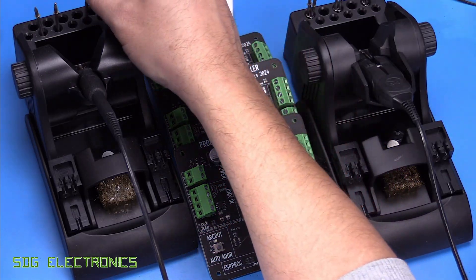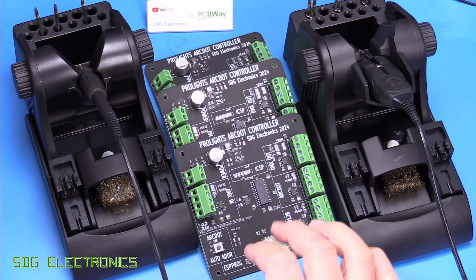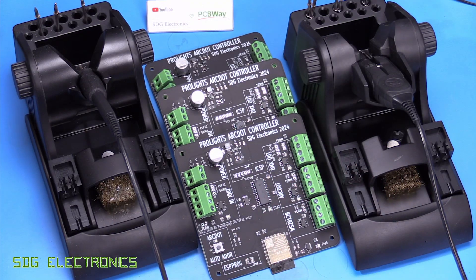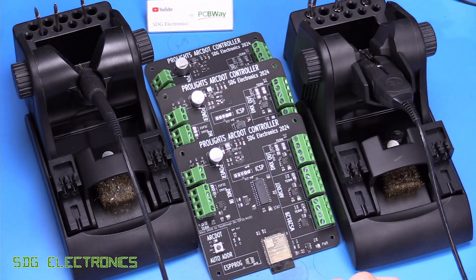These soldering irons and desoldering tweezers do work very well. Also, if you're in the market for something like these and don't happen to have the Metcal base station, they do actually work with the Thermaltronics systems as well. I did test it and they work perfectly fine with those units — they're quite low power, so any incompatibilities or slight difference in impedance isn't really noticed because of the very small cartridges.